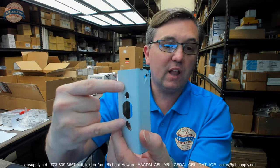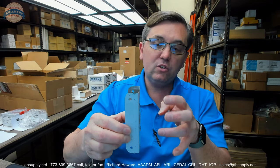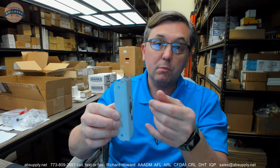This sort of door reinforcer tells me that the door is not compromised at all, because you're not attaching the latch bolt to this piece of equipment and then all of it attached to the door and then securing it. You're literally using those screws to go through the latch bolt that's mortised to the edge of the door and sinking that into the door stile itself. In door reinforcing wraparound plates, it's assumed that the door is damaged in that area. So you physically attach the latch bolt to the door reinforcing plate with machine screws. Then that whole reinforcer and the attached latch bolt, that goes onto the door.